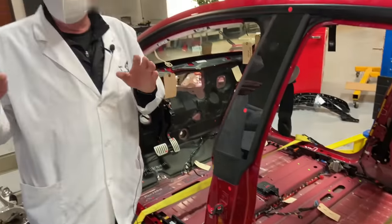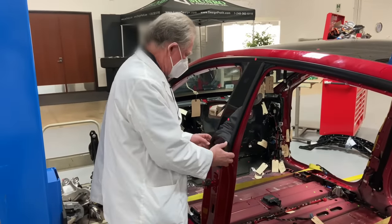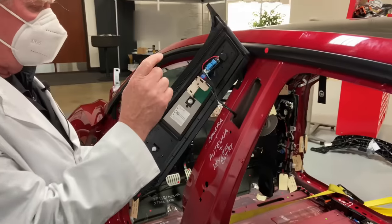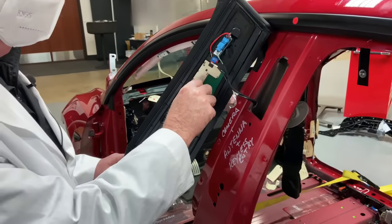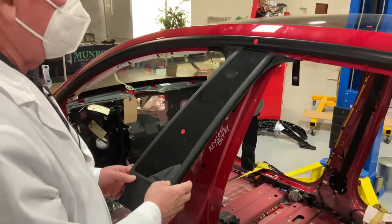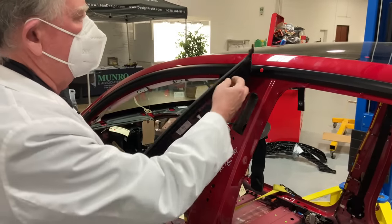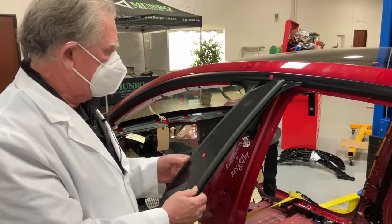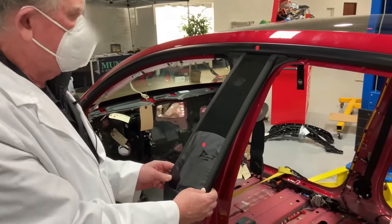Now let's have a look at a couple of other things we found in the last couple of days. This B pillar has a lot of surprises in it. It's got the camera and the antenna for the keyless entry inside here. It's a rigorous snap fit, which I kind of like. The other thing I like is that the closeout — the blackout here — has also been overmolded. That part is put inside a molding machine and they do what's called dual durometer injection molding. So you get the cushy foam stuff helping out for NVH and also for sealing.